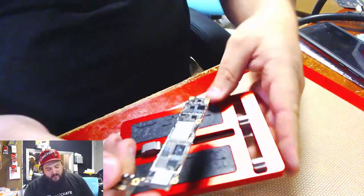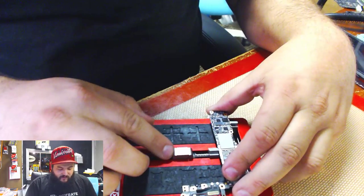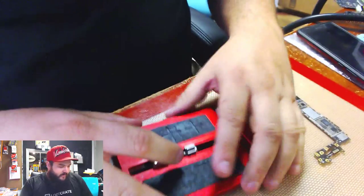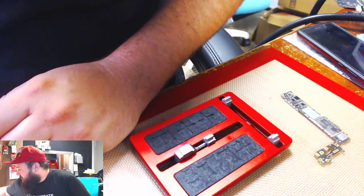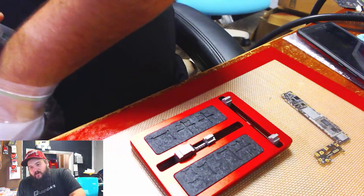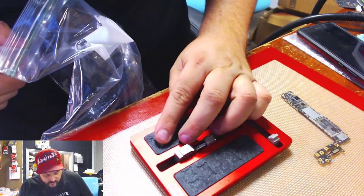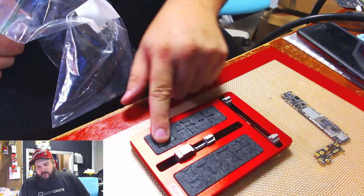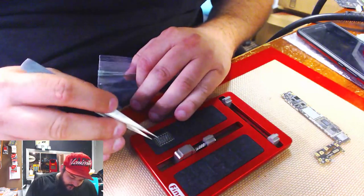It's really convenient — I really like the product. It's fairly cheap at $30 for a holder with an auto-locking option, which is awesome. Another big positive is it has cutouts for different size chips. I specifically use the one for NAND — I can take off a NAND chip and place it right in the holder and it will not move, so I can work on that chip without any issues.